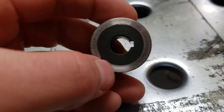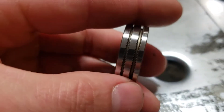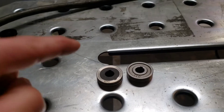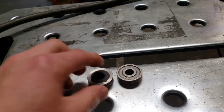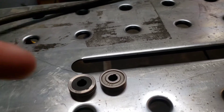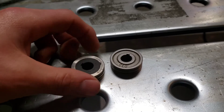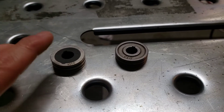What I was having to do was constantly grab a piece of wire and push it in there to scrape all that gunk out — and that's not even after feeding a ton of wire through. I haven't had one issue since I purchased the knurled roll. When it's not feeding correctly, you get holes and porosity inside your weld puddle, and it'll slip because even when you tension it down you start squashing your wire since it's got flux in it.